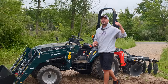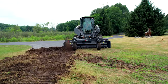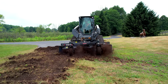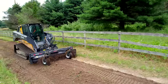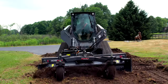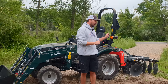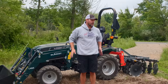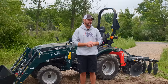We're using the Summit Tractor today, hooked up the four-foot disc behind it. We showed you that roto rake that we used — not really the right application for this road project that we're doing, but it was a safe area to test it on. I knew I wasn't going to screw anything up too bad because I could come back through and take all this dirt out anyway. So that's what we did today. We got that sod off of there with the roto rake, and then came back with the disc — really easy.